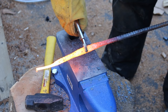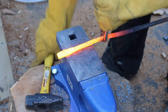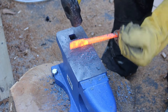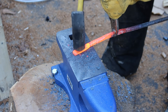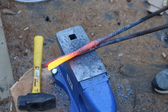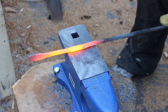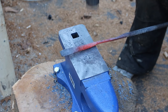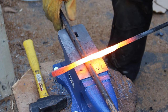Next, take a pair of vice grips and grab the flat part, the offset, and use the hammer to make sure that the tip is 90 degrees to the flat spot — really eyeball that carefully. You want about a good three inches of flat teeth, but this is up to your preference. Test the two pieces together and imagine whether they're going to work together, then tweak and adjust. My offset portion wasn't long enough, so once you've got it right, it should look a little bit like this — then you're ready to bend the jaws.